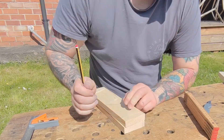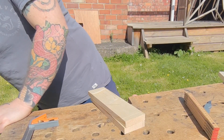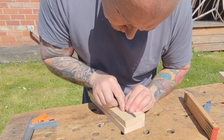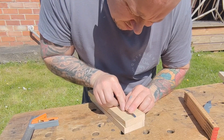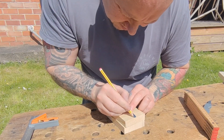I use a chisel for the center piece. Because these dovetails are Japanese-inspired, there are different variations on dovetails — the pin actually has what you would consider a finger joint in the middle. That's why I'm using the chisel, to make sure I can actually get it down there.